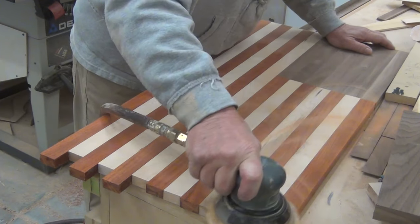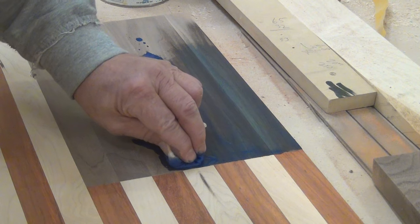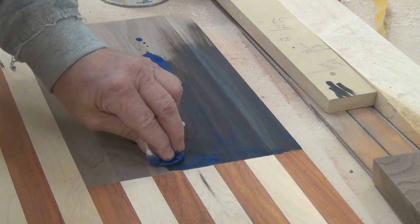Alright, it couldn't be quiet any longer. Now you have to sand it after you sand it because the drum sander leaves striations and grain.